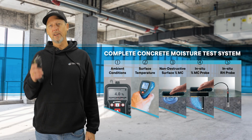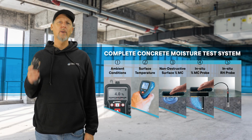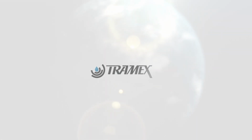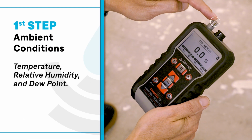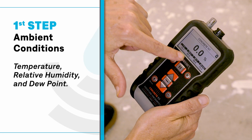If you want to have a clear understanding of the moisture condition of a concrete slab, Tramex recommends the complete concrete moisture test system, also known as the 5-point test. The first step is to record the ambient conditions, including temperature, relative humidity, and dew point.